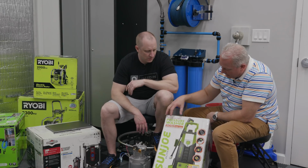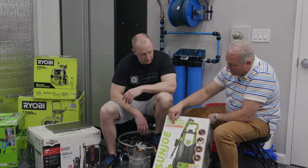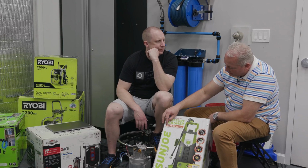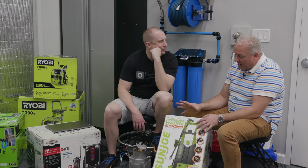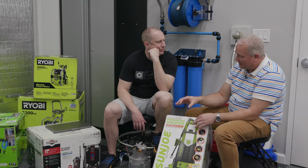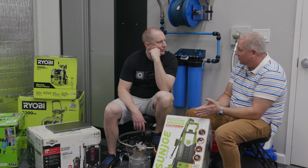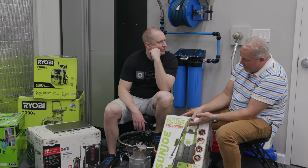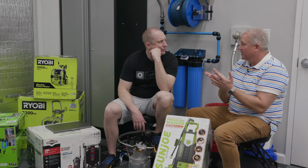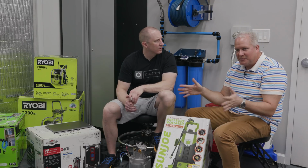So what the qualifying language is telling you here is just the way that they rate their machine, at initial discharge per the CSA internal pressure. What they're saying there is the UL test, I think it's UL 68.1.3 or something like that, they look at. In the case of an electric pressure washer, it's the total stop switch, right? When you release the trigger handle, the pressure builds up in the pump, and that TSS switch is then activated and shuts it off. And when you squeeze it, the pressure drops and it turns back on, right?